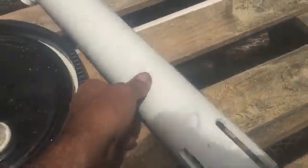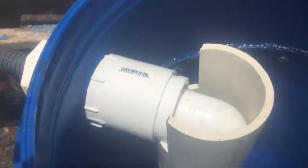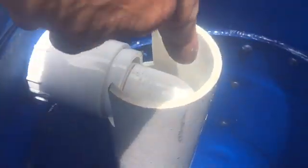Let's go ahead and put this stuff in. I'll show you putting this thing together — I'll take the bottom back off and show it to you. We set the pipe down, and it'll sit right over top of that dimple on the bottom lid. Then it just plugs into the inflow hole, and this piece of pipe fits right there. So now all the water coming in from the spring comes in here and is forced down this pipe inside this one. Hopefully it'll settle down some before it comes back up and heads out this hole, which holds the filters on.